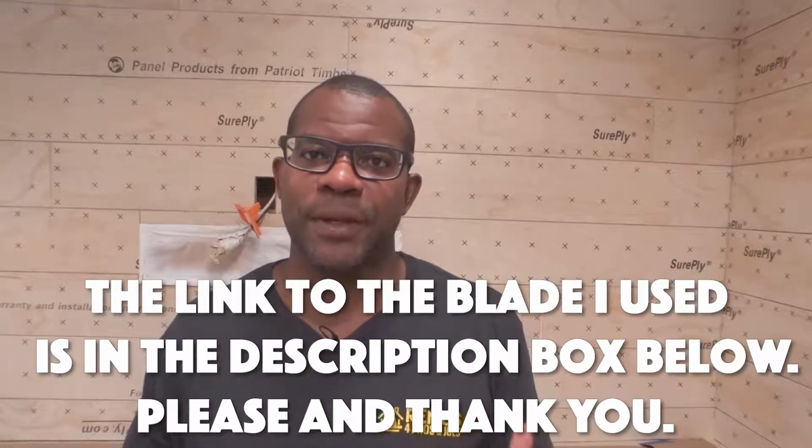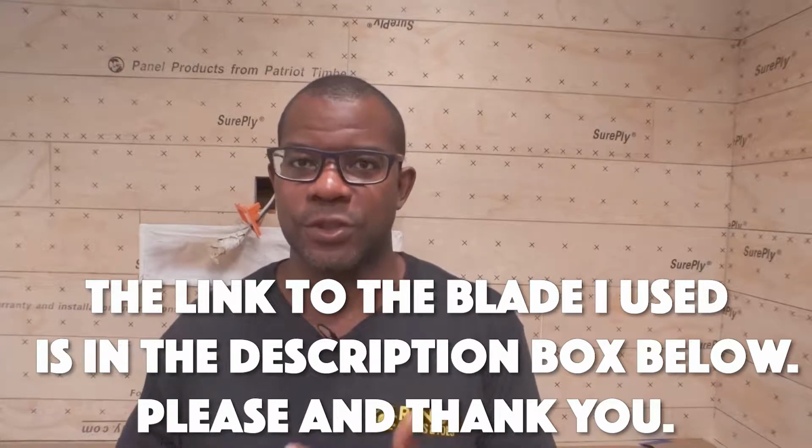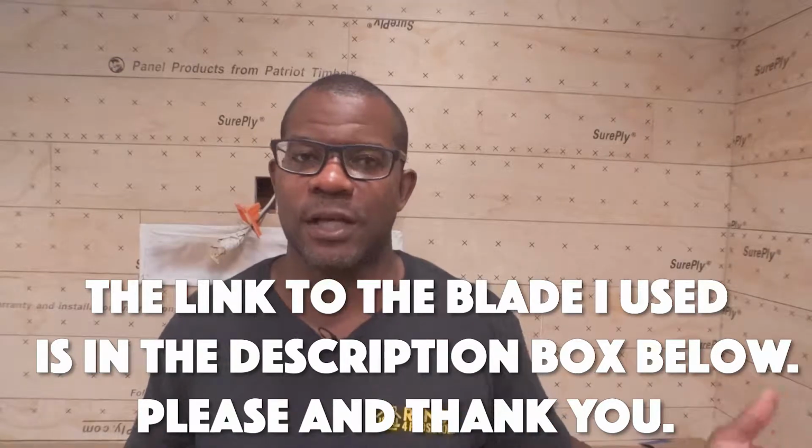So what I propose that you should do, and what I've done on this project is, I've cut my own panels down using a table saw, and then I've trimmed all my panels using a miter saw. And the big thing with this is you want to make sure that you have the ideal blade for cutting. That's one of the biggest differences between cutting the boards yourself versus having them cut in the hardware store.